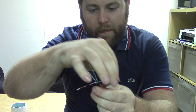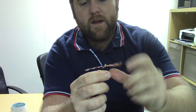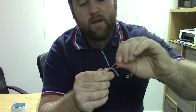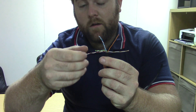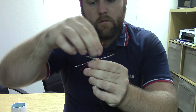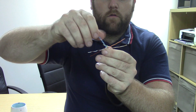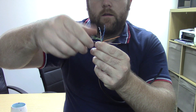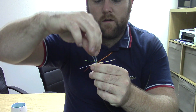I'm going to show you one standard pin assignment. If you make a patch lead, it doesn't really matter where the pairs go as long as they're end to end — so pin one goes to pin one, pin two goes to pin two, and so on up to eight. But it's good practice to do it to a standard. The first time you do these it's going to be really fiddly and you're probably going to mess it up a couple of times, but stick with it — when you get it, you'll wonder what you found so difficult.